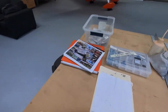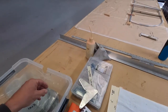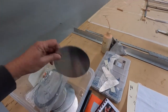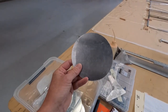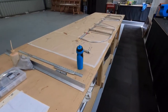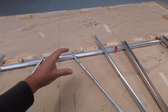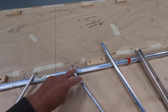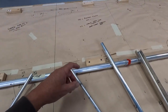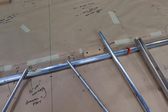All you get in the kit is the two bell cranks, which is great. That's the only way I know that there's a bell crank either side of the elevator, and these 6-inch circles, which I'll cut into gussets. A lot of manufacturing and a lot of repetitive work. So you probably saw, I'll cut the gusset, center line, cleco it, do the other side, bevel it, remove it, deburr it, clean everything up, get the swarf out, then final rivet.